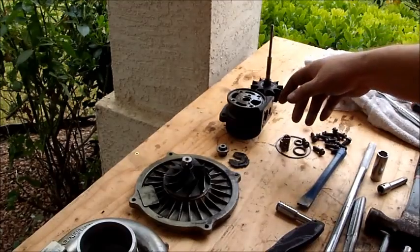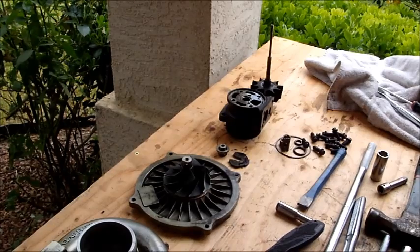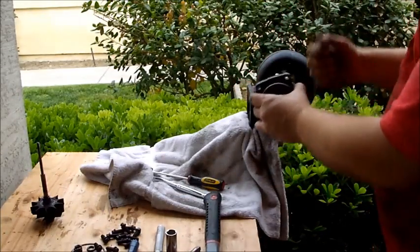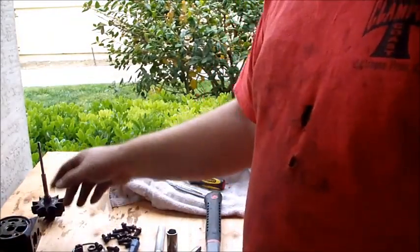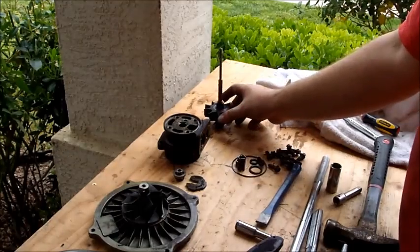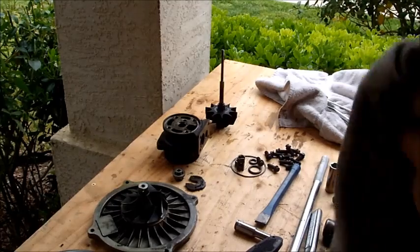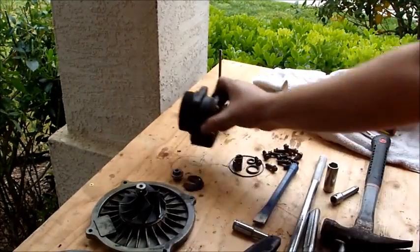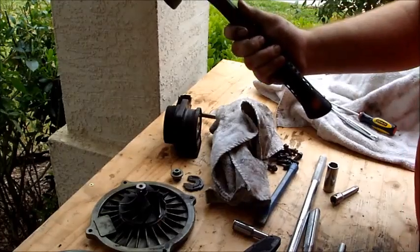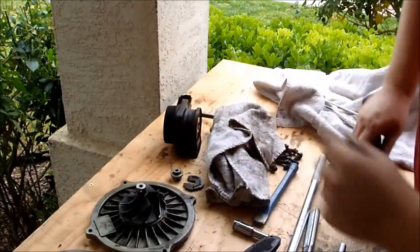With all that off, you can gently persuade the carrier away from the exhaust housing. You can see the hollow exhaust housing over here — gently clip-clap this piece off. Once you get that piece off, you're looking at gently persuading the shaft out. They recommend a rubber mallet. I was too lazy to go get one, so I had the carrier stacked with the shaft coming through it, put a towel over it, and hit it with my light electrician's hammer — just bink bink — and it popped right loose out of the carrier. That's the last piece to come out.